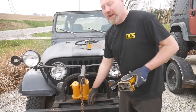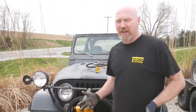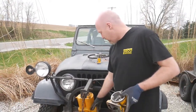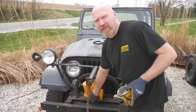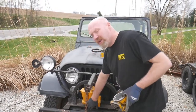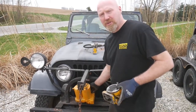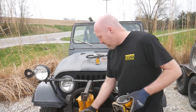We rebuilt the whole pump and threw some paint on it. When we did that, we actually learned that whoever had taken that pump apart had not put it back together correctly — they had not replaced the baffle that goes down inside the cylinder, and they actually hadn't even put the check valve back in that goes between the pump and the cylinder. So we had to buy a new check valve, get that going, and once we adjusted our pressure, that pump worked great and picked the plow up with no issues.